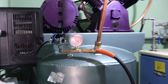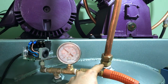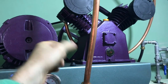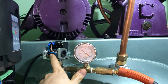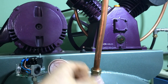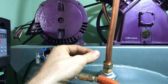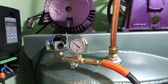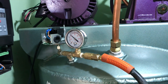The air compressor is pretty much finished up. A few things I didn't think through well: you're supposed to have a check valve where the air comes in off the compressor head — that helps keep pressure from bleeding through the rings. Also, the pressure switch should have a system that when the motor turns off, it releases a little air off the head, so when the motor restarts it doesn't have full load on it. It starts up, reaches equilibrium pressure with the tank, and then starts filling the tank. I still don't have that installed yet, so it's not kicking on and off correctly. Also, this pressure switch is for a water pump and isn't really ideal — it won't work for that.